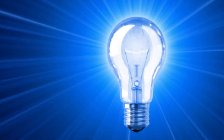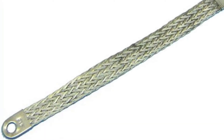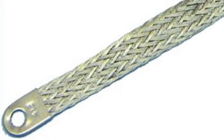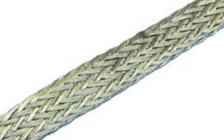Many amateurs harbor the notion that DC grounding an antenna will magically act as or replace a ground plane. It will not. The only way a ground strap could act as or replace a ground plane is to make it long enough to be a radial — and that's a ridiculous notion. While the DC strap may indeed DC ground the antenna base, and it might RF ground it too depending on its length and width versus the frequency of operation, it is by no means a replacement for a ground plane, nor is it a substructure for proper bonding.